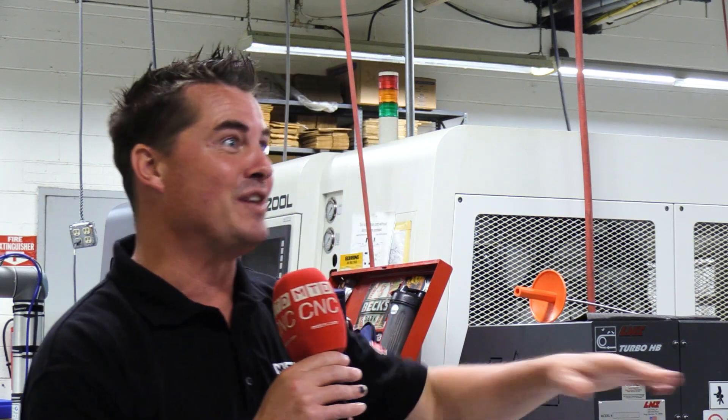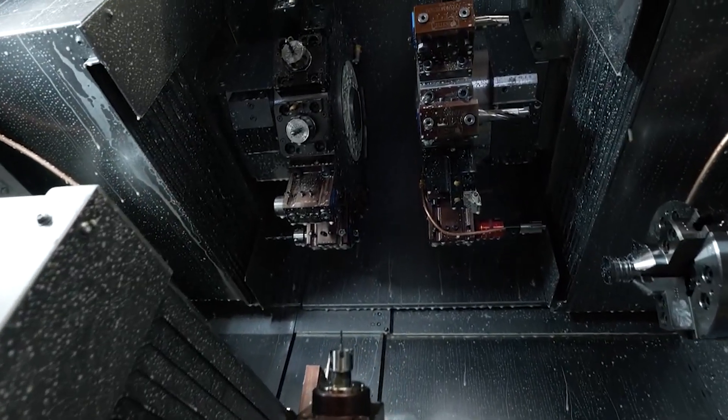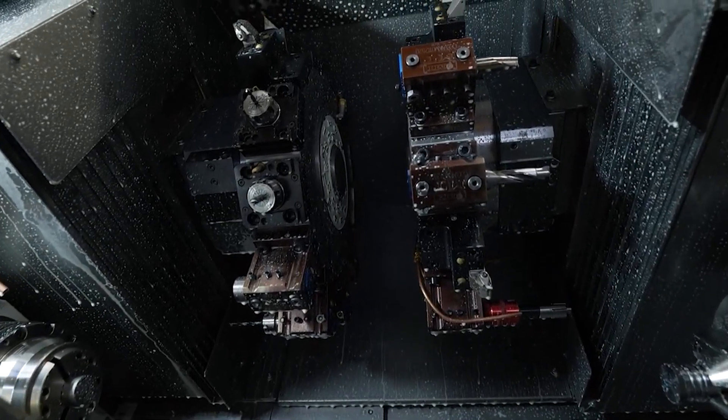Cordell, much like this conversation, you and I are both very versatile, and so are these Nakamura machines. You can start from a basic bar stock to a finished part without even opening the door, because it can start the first operation, switch over to the next spindle for the second operation, part it off, the ejector will come in, push the part out until the parts catcher grabs it, and pulls it back in. Next part is already running — very, very versatile.